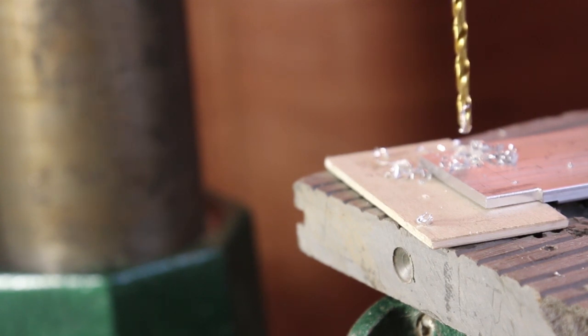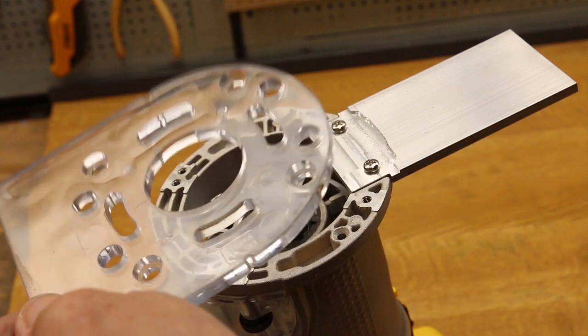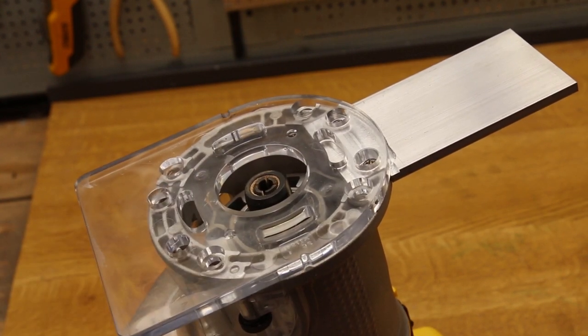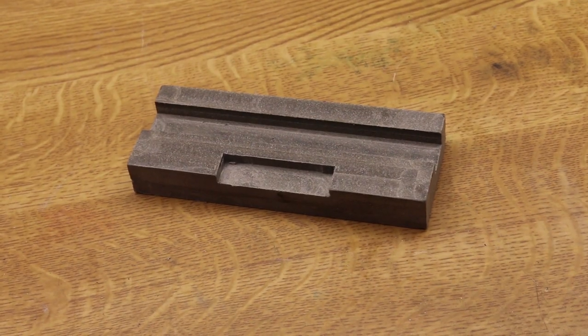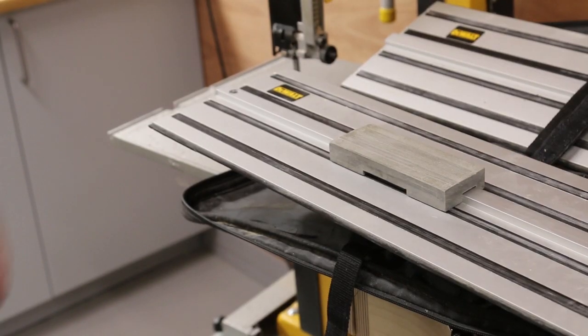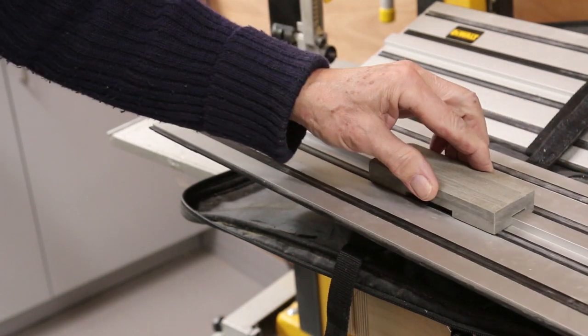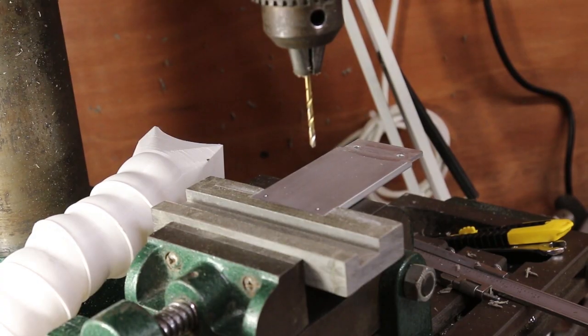Despite being an American company, all the fittings are metric, so this is a 4mm clearance hole. Here it is mounted on the frame using two 4mm bolts, for which there is already clearance in the base plate. Cut to size, it's surfaced and then trenched using a router to provide this. I then squared off the slot using a chisel. Here you can see the block sliding smoothly on the track, and it's really quite a good fit. I will continue with fitting the manufactured part, as that requires more steps.